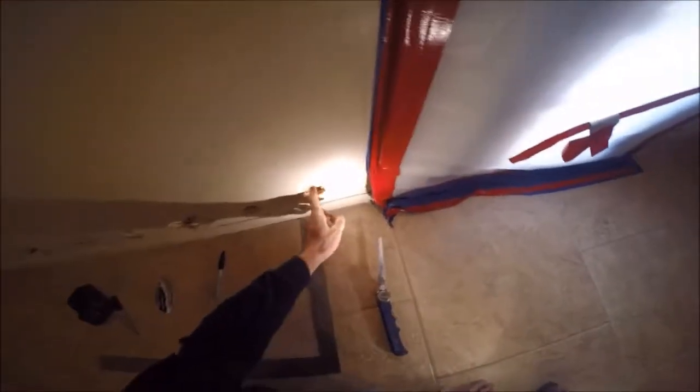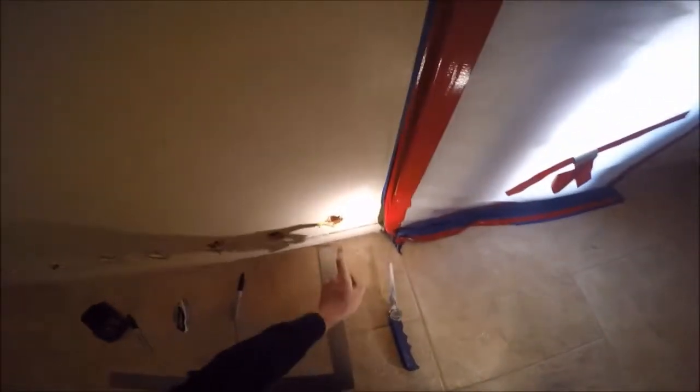We're back. The restoration guys drilled holes to dry this place out. One of them hit a half-inch copper line that's in the wall. I got my square sharpie, I'm going to make a nice cut here and access it, then cut out the damaged section and repair it.